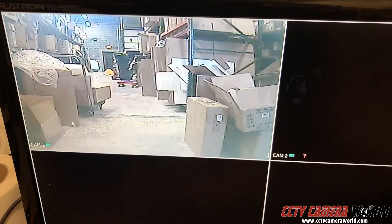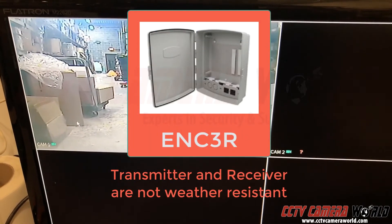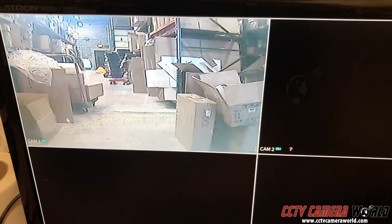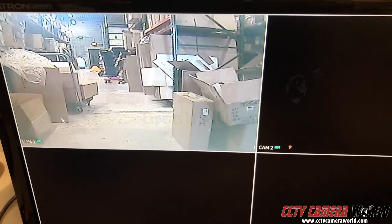That's why you want to make sure you have clear line of sight with no obstructions in between the signal path of the transmitter and receiver. The transmitter and receiver should be placed in a NEMA enclosure — that's a plastic box by the way, no metal — or you should be using high-gain panel antennas to amplify the signal if you have weak signals with the existing antennas or if you're transmitting only through glass. Hopefully you found this video useful, thanks for watching.